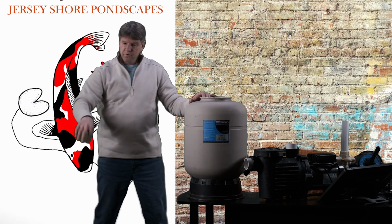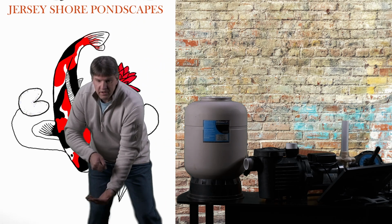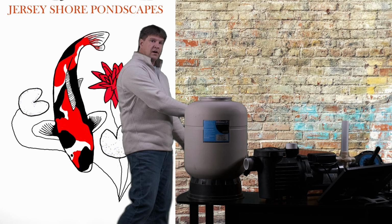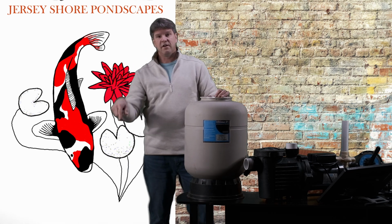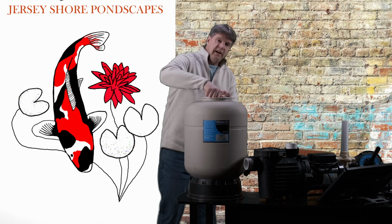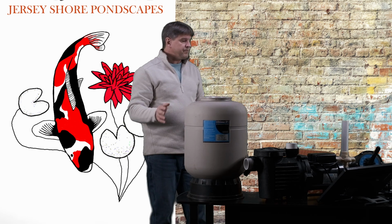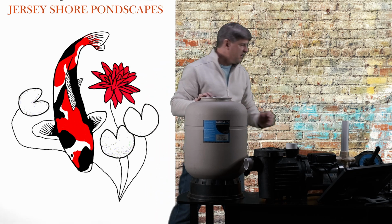I take a few scoops, put it in the net, take the water hose, clean the whole thing, spray it all full of water till those beads are clean. Then I dump the beads out into a 5-gallon bucket. And we keep doing that until you have all this stuff out. Once all these beads are out and everything's clean, spray the whole inside of the tank, clean the whole inside of the tank out. Dump it out, get it all nice and clean, like brand new again.